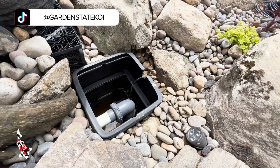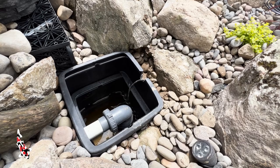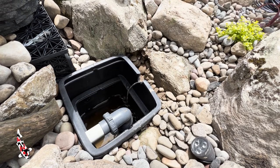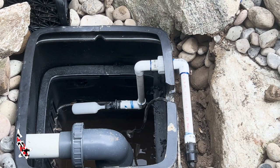We're looking to mount this fill valve about 6 inches below the top of the reservoir Aquablox. In order to do that, I'm gonna have to use the PVC pipe elbows and union to make an extension for the autofill valve to sit lower inside the pump vault and to be able to be maintained for the winter months or if ever need to be replaced. Easy access.